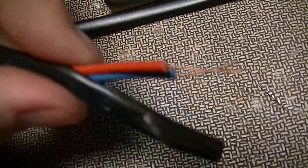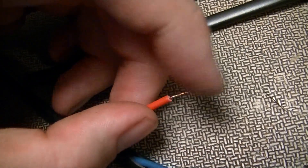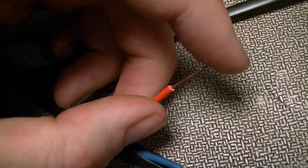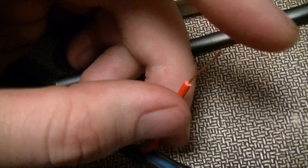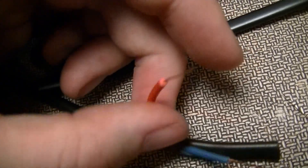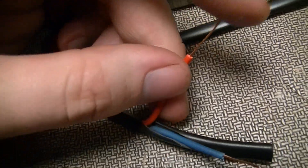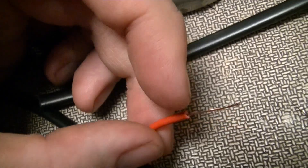Just cut the thing open and those are 22-gauge wires, which are not suitable for six amperes. You can get away with it in applications like Christmas tree lights — and that is what's used for Christmas tree lights — but those, you're talking about three amperes absolute maximum. That's when fuses start blowing in the plugs. And those are bare conductors in open air where it's cold. Normally if you follow the ratings on the boxes, you'll never get above one and a half amperes at most. So yeah, that is not suitable for six amperes.